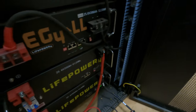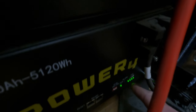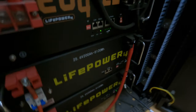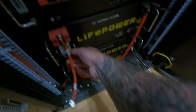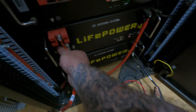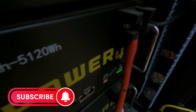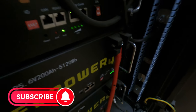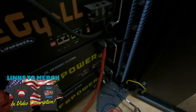This is the first time I've had to touch these batteries since I hooked that inverter up over a year ago. The inverter fan is on so it'll be kind of loud. This one is completely charged — topped off at 100%. Now I'm charging this bottom one. The bottom battery is now 100% charged — all the lights are lit up. I'm going to turn this battery off and back on just to see if it's changed — still showing 100%, it hasn't drained at all. This took probably four to five hours to top balance both batteries. Now I can hook these back up to the bus bars.